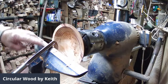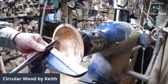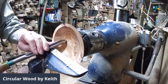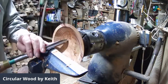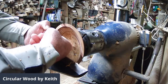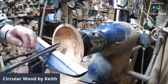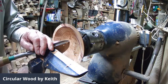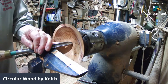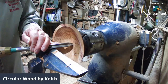I come in with the bevel pointing between 5 and 10 past on the clock. As I go down, I'm opening it more, so now I'm pointing at 5 past. As I get to the transition between the side and the base, I'm about 3 minutes past. That means the smallest amount of metal on the nose of the bevel is following me round. Once I've gone past the little sharpish edge in there, I can then flatten back out again. I'm now again between 5 and 10 past, and I'm lifting the handle slightly to get to the centre and finish at almost quarter past.